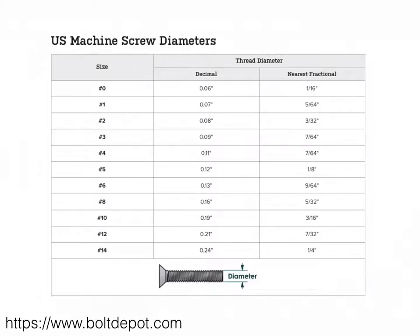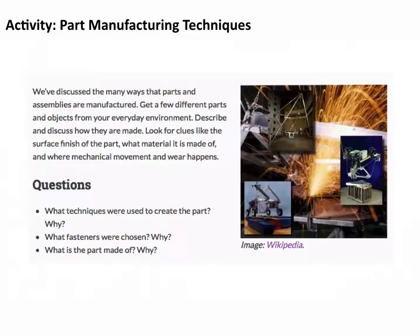I've handed out a table with some of the most common screw sizes and their nearest fractional and decimal thread diameters. Now we're going to do an activity — I'm going to hand out a number of common items, from staplers and can openers to a razor knife and some other items, some custom items. I want you to look at them and try to figure out what technique was used to create that part and why — generally because it's cost effective, fast, or strong. Also identify what kind of fasteners are used to assemble the different parts and why those were chosen.